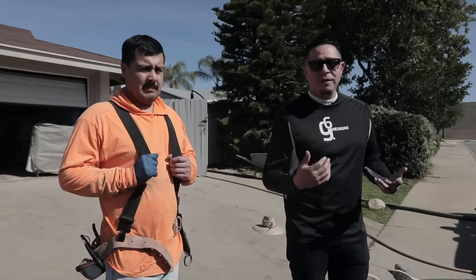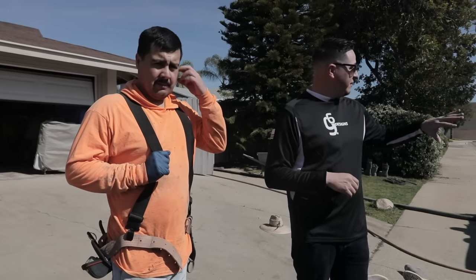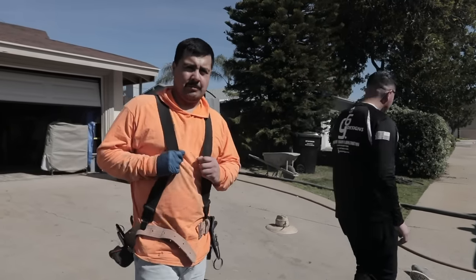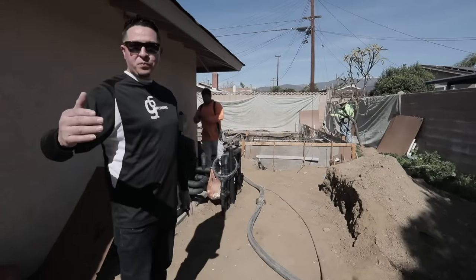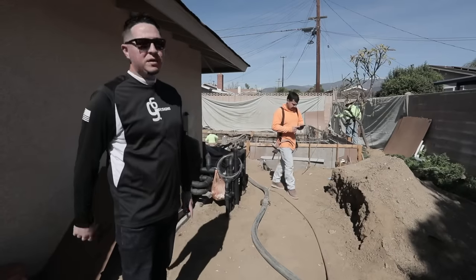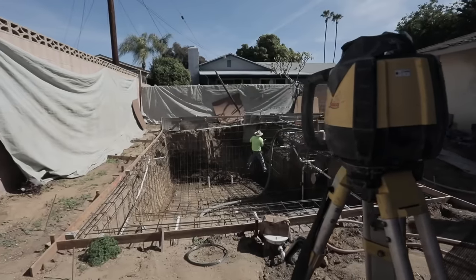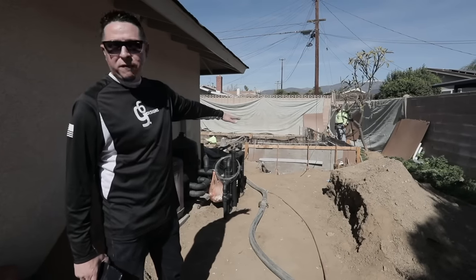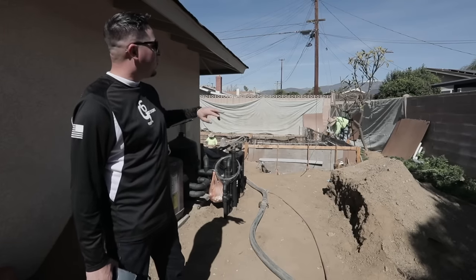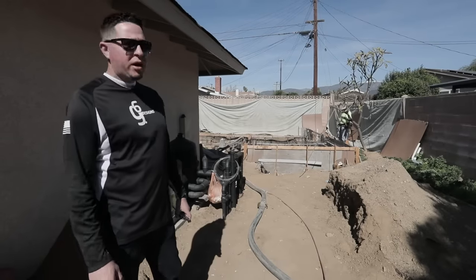Baja Shotcrete takes care of us. Today was unplanned — we had a cancellation somewhere else and said, hey, we're ready to go, let's shoot it. So if you're a builder and you're thinking about shooting, you better have at least six to ten shoots a week to even pay the bills. If not, it ain't even worth it. A good crew keeps everything running smoothly. If you've got a shotcrete crew showing up last minute when the pump's already here, that mud is getting hot — it can clog up in the hose. So a good crew is going to show up early. You see he's shooting all his elevations, meaning he's getting a reference level of what the finish deck's going to be. What I show on the plans is my finish grade for the bond beam, and then he's running wires to guide the guys as they're cutting the concrete.